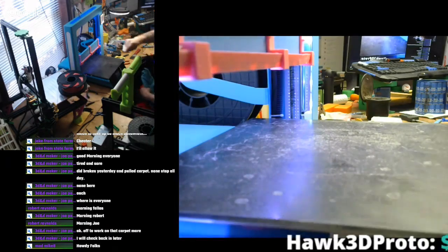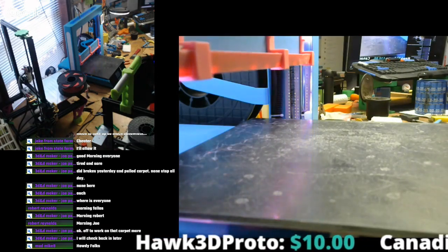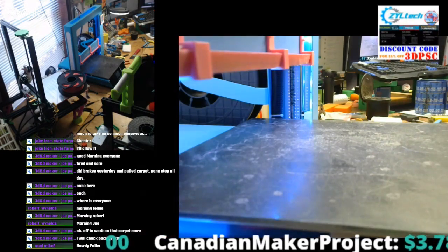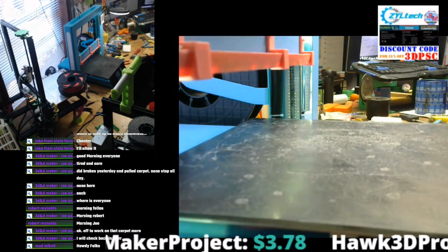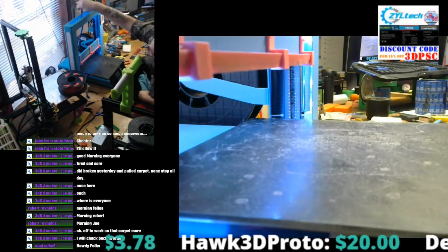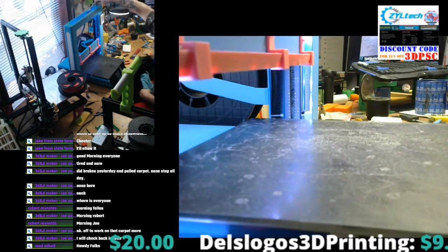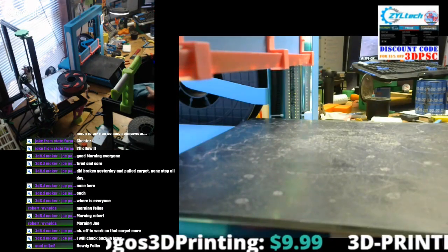Howdy, folks. Hello, hello. Hey, Mad Mike, how you doing, buddy? Tanner, we got the extruder problem fixed on the JG Aurora. I don't know if the tip was clogged, but I stretched the spring, cleaned the nozzle, shortened the Bowden tube up a bit, made it more of a direct path instead of the dookie ass, let's see which direction we can make it go. That thing was all curly and everything, so it looks a lot better now. So we'll see here in just a minute. What you got going on today, Mike?